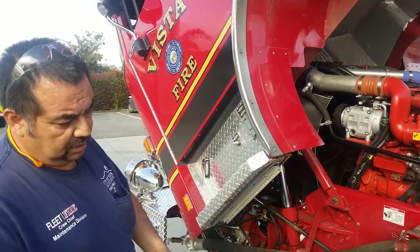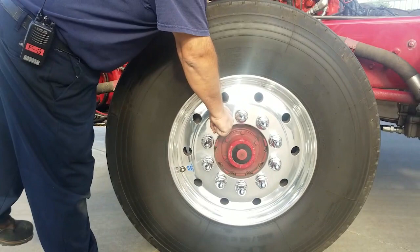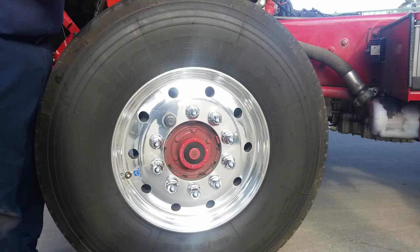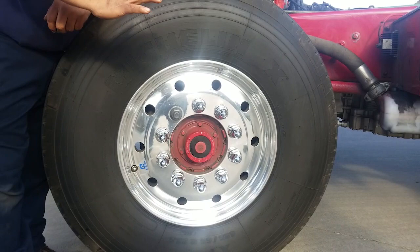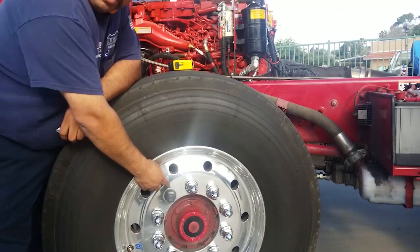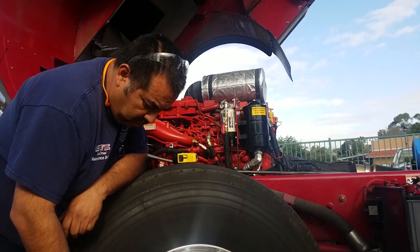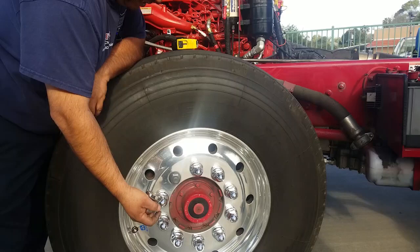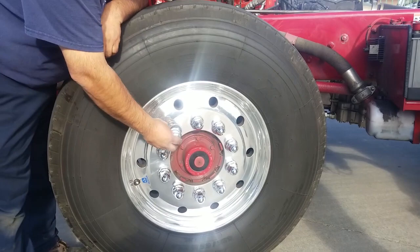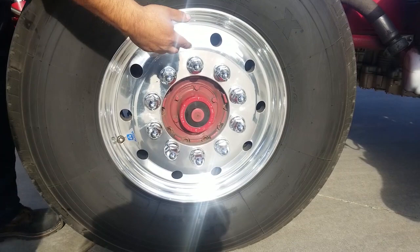When you're at the wheel, take a look for indications of a loose lug nut. These may have a chrome cap — pull it off if you have to. Aluminum wheels don't rust, so you won't see rust — instead you'll see what's called galling, where aluminum is oozing out of the rim. That means the lug nut is moving and squishing the aluminum out, which indicates the lug nut or wheel is actually moving on the hub. You also want to look for rust or streaking on lug nuts: bright orange is active and fresh, indicating looseness or cracking. Dark red, dirty rust is old surface rust that isn't doing anything. Look for indications of cracks anywhere on the wheel surface between lug nuts or on the ventilation holes.